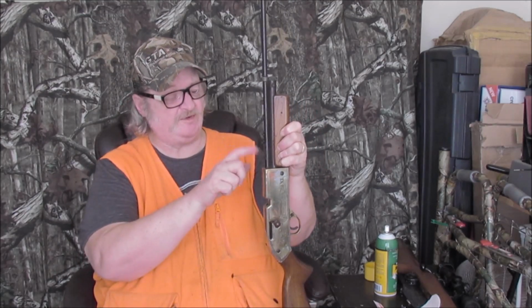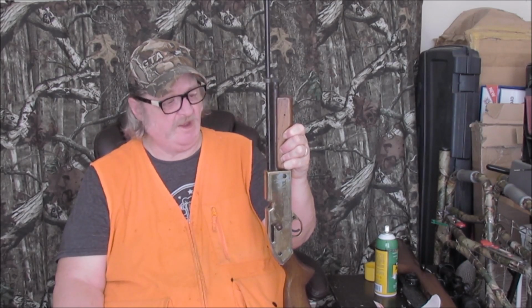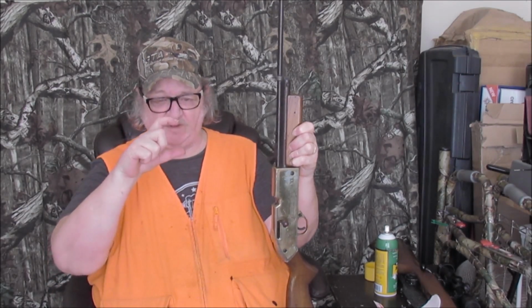And small parts like the screws and the sights, you can use a stainless steel wire wheel and a Dremel to polish them up. It gives about a 600 grit shine. And glue them up, and then you can put them in a small container, covered with bluing, to soak for half an hour or so, and they come out looking good.